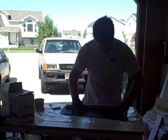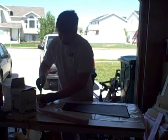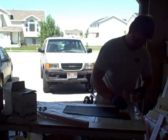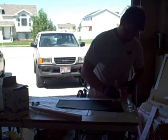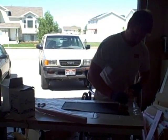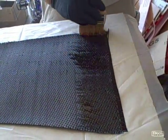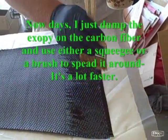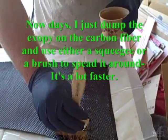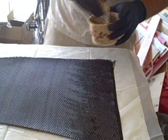So I've got my carbon fiber laid out how I want it. I'm going to go ahead and move the core, and then you're just going to take this and do what's called stippling. What we're trying to do here is get the carbon fiber wetted out — I want to make sure I get this really good and wet it out. When we vacuum bag this, I'll use a breather cloth set up so that it will soak up a lot of the excess epoxy.